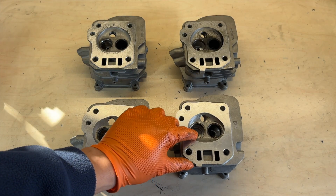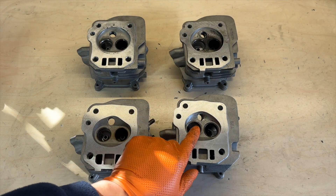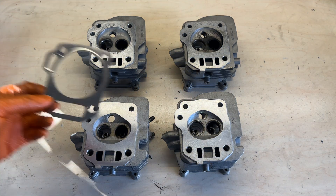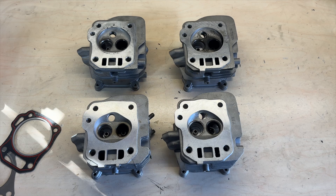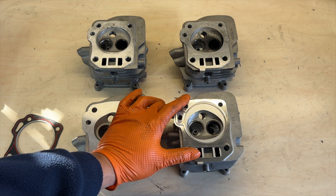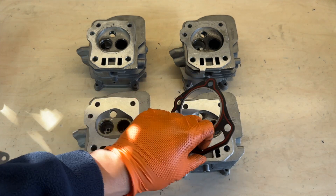What I did was enlarge the valve — this was one of the first ones I played around with. I took the bigger valves from an old 27-25 head and installed them here, so you can see I didn't machine it perfectly. Testing on the engine gave an extra 1 to 1.5 horsepower. However, with a thin gasket the compression ratio goes beyond 13:1, which requires much better fuel and ignition timing, so we stuck with the thicker gasket which gives us around 12:1 compression ratio.